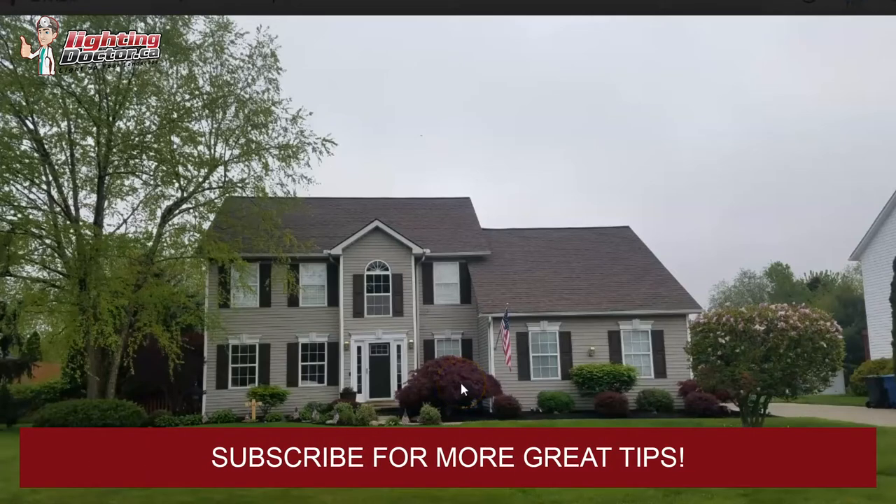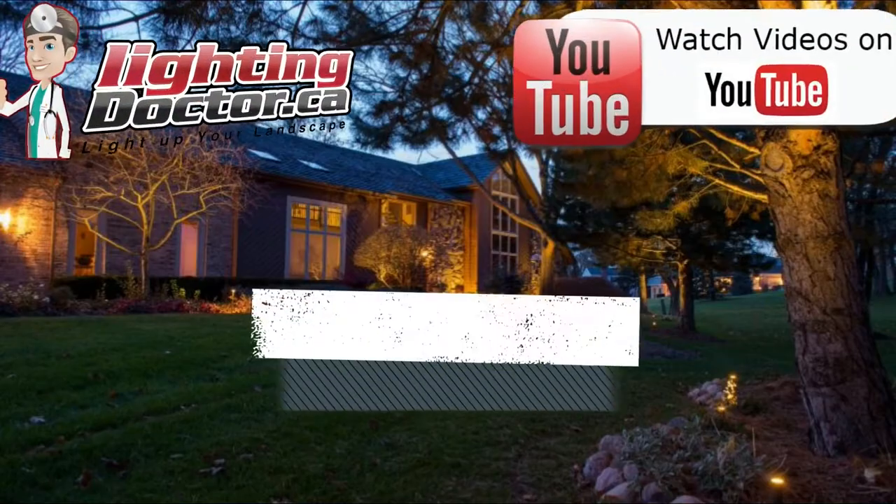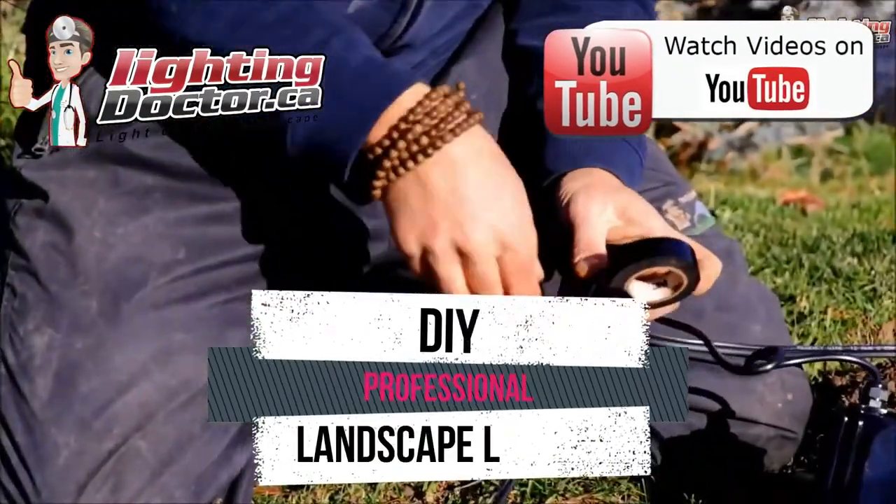My train of thought with that is I just find you get so much more bang for your buck, and it just stands out. You get more of an effect with an uplight than you will with a path and garden light. I find so many first timers, do-it-yourselfers, landscapers who don't do a lot of lighting — they just throw a bunch of path lights and it's like they're trying to land a plane. Whereas if you're strategic with them, I think it can be a good fit, but you always get more value out of an uplight.